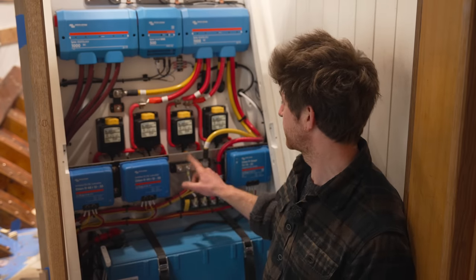So it'd be nice to be able to visually see that action. This is all a cooling system for the hybrid motors. They have what we call a closed circuit cooling system, which means that they have ethylene glycol in them, and then we use this cute little heat exchanger that runs seawater through tubes that run opposite directions with the glycol, to transfer the heat from the hybrid motors into the ocean.